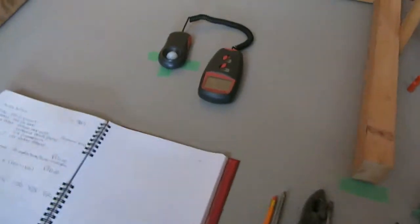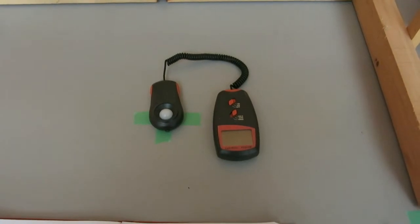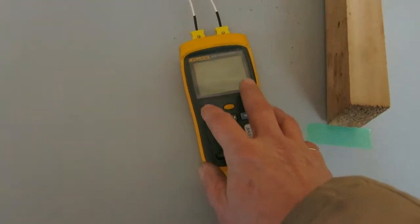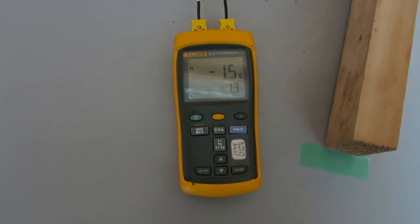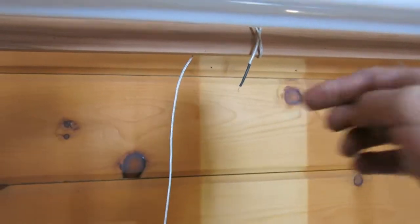In the center I have a photometer — this one measures lux — and I have a temperature meter. There are two temperatures: one is the temperature up on the frame here, with a thermocouple, and the other one is inside the fixture, mounted with tape onto the ballast, so I can measure the ambient air temperature and the temperature of the ballast.